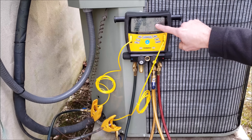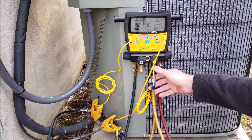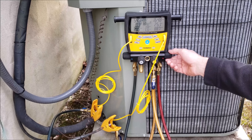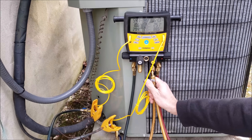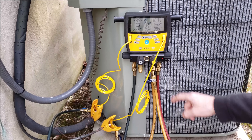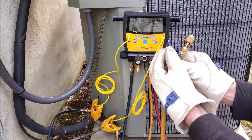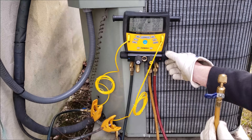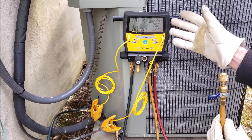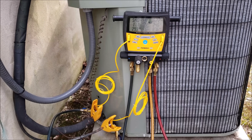The subcooling reading has not changed — we are overcharged, which means we have to take refrigerant out of this system. We recover it using a recovery bottle attached to the yellow service line. We de-charge the system using the manifold handles. We purge the air out of the hose first, then attach to the recovery bottle, and de-charge a little bit at a time. Make sure you have your safety gloves on. Since this is a four-port digital manifold gauge set, we use the system's own compressor to help push the refrigerant into the recovery bottle.